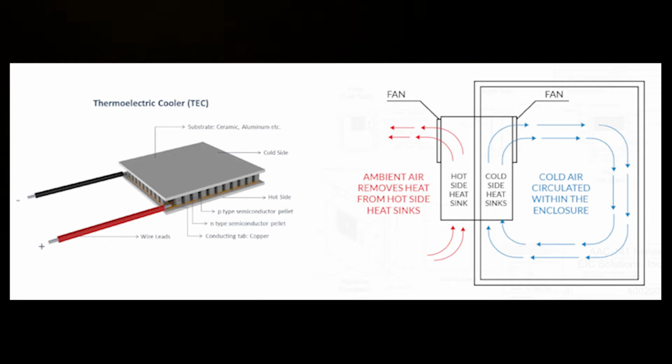Thermoelectric coolers, or Peltier tiles, operate according to the Peltier effect. The effect creates a temperature difference by transferring heat between 2 electrical junctions. A voltage is applied across joined conductors to create an electric current. When the current flows through these junctions of the 2 conductors, heat is removed at one junction and cooling occurs. Heat is deposited at the other junction.